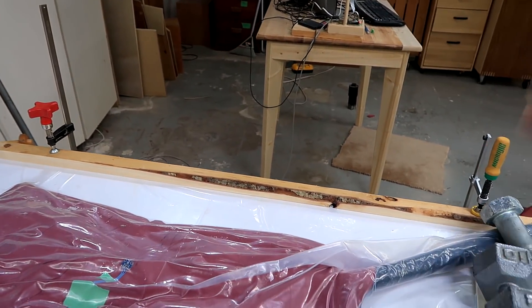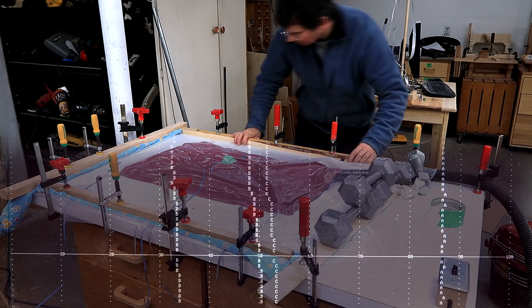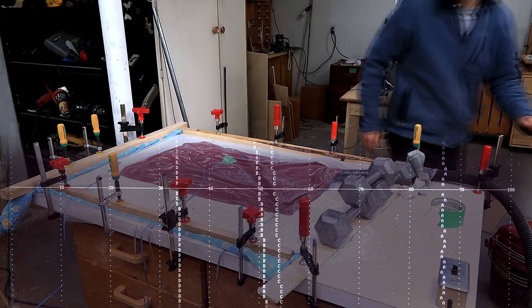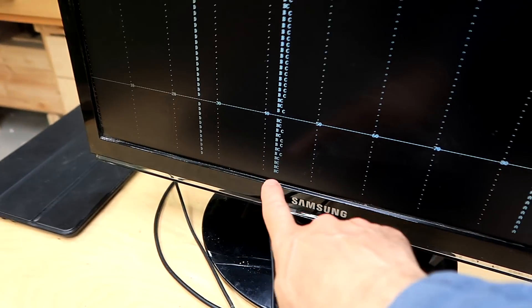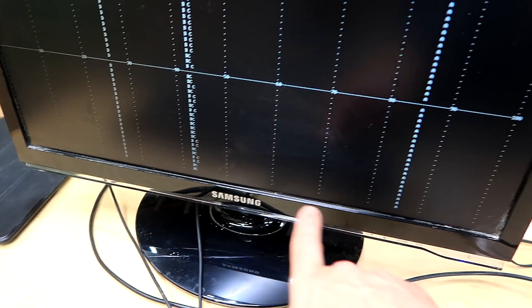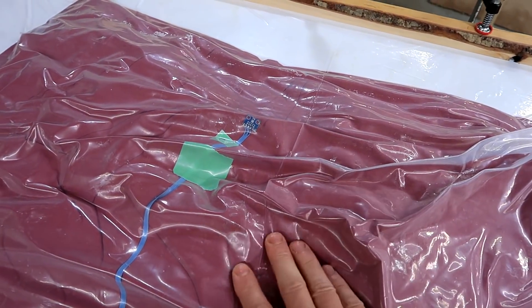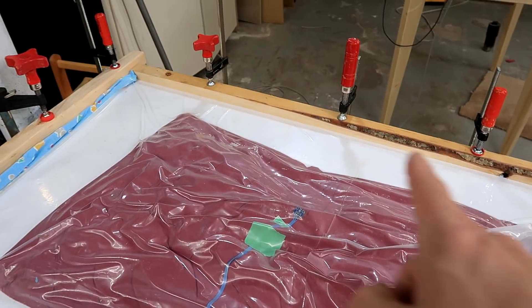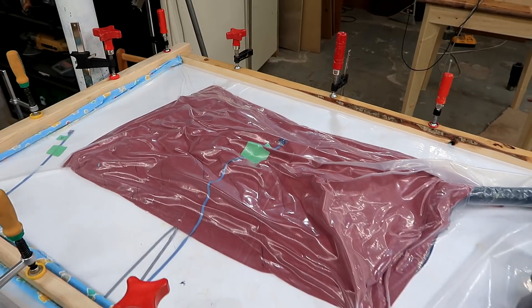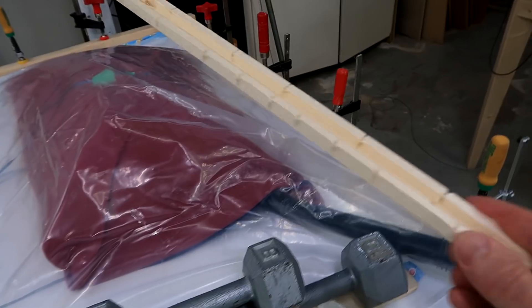I just realized I forgot to put clamps on the back. I'm just not getting the same level of vacuum across this pillow. Sensors B and C on top of the pillow have only got half as much as I got on the input. So even though this pillow is permeable, the air flows through it very slowly — not making up for the leakage around the edges. I'll stick this along the edge of it to spread that vacuum a little bit better.